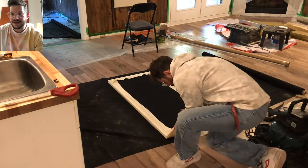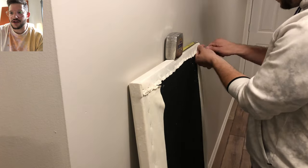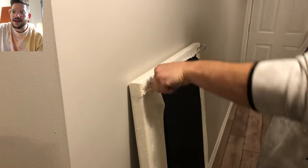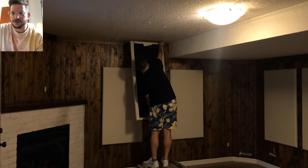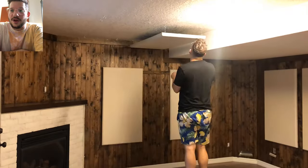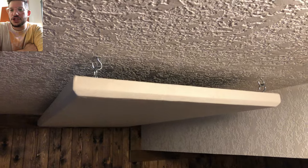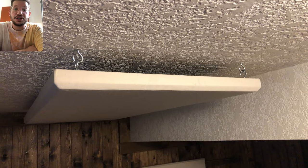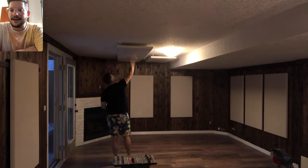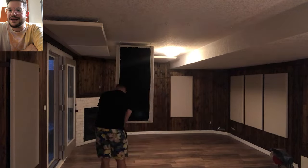We are going to upholster these cloud frames now. Once everything is upholstered we can get our screw hooks installed in the cloud frames — going in about three inches on both sides, using a small drill bit to pre-drill so it's easier to screw those screw hooks in. I used a little bit of chain on the screw hooks just to help swing these panels up into position. Once it was up in the air I was able to remove the chain and go directly hook to hook. Without the chain, hook to hook can bind a bit when first attaching, and I want to minimize stress on those drywall anchors. You wouldn't have to do this with a second pair of hands, but I was hanging all of these by myself. There you can see me going around the whole live room getting all the clouds mounted up.